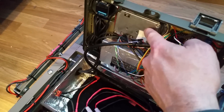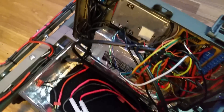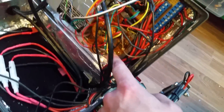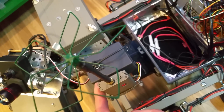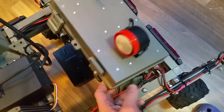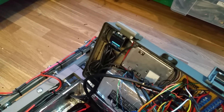Here are some buck converters: 12 volts for the lighting, 5 volts for the Raspberry Pi, and 4.3 volts for the lamp. Down here under here is the relay board to turn on and off the lights, the transceiver, or the video transmitter — and also to turn on a siren to make an awful sound to scare away some people, maybe. There's also Wi-Fi and a little LCD here to see the IP number.